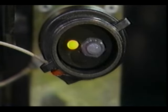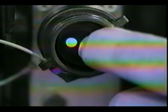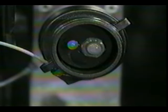Press the switch for 1 second and release for 1 second. The LED should come on, then go off. Repeat this action 2 more times, letting the LED come on and go off each time. If there are no active faults in the system, the LED flashes quickly 8 times to confirm that the memory is clear. Next, the LED continuously flashes the system configuration code until power to the ECU is removed.